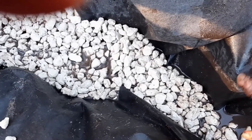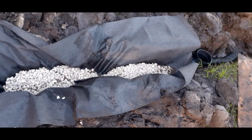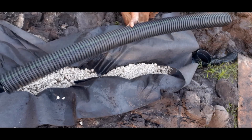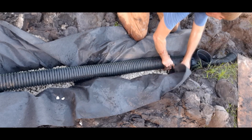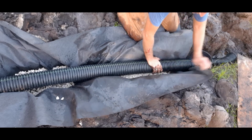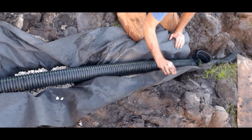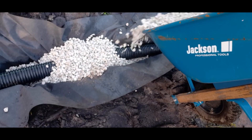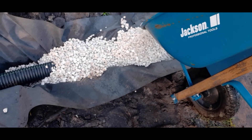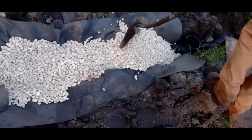Again, remember the dewatering system. French drains collect subsurface water. Catch basins collect surface water like a storm drain. This is a proper French drain. If you're still a believer in fabric and you're going to build this system with fabric, that's fine — just make sure you put a base of gravel under your perforated pipe. Connect a catch basin for the surface water. Base of gravel, pipe, surround that pipe with gravel — you're giving that water a place to go. That's what the French drain does. And don't forget your catch basin for surface water collection.